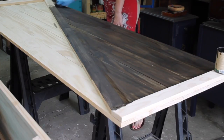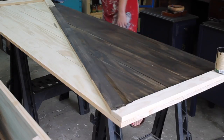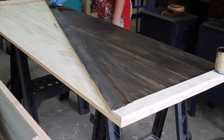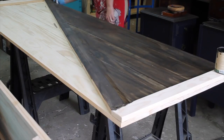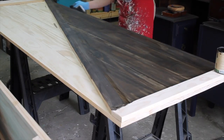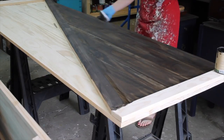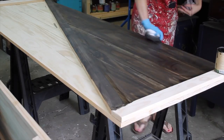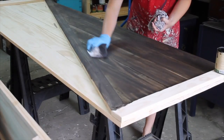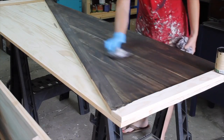The other thing I'm going to do is apply the top coat after it's been installed, and the reason is the same — once the door is hanging up it's much easier to access both sides. I'm just going to use a water-based top coat and only give it one coat, which is okay to do inside. I find it's just an easier process when it's hanging and already installed. Just one coat is fine for a door — it just helps make it easier to dust and keep clean.